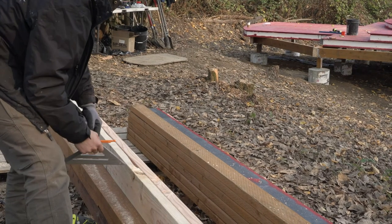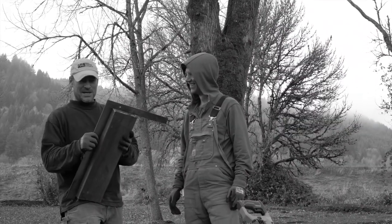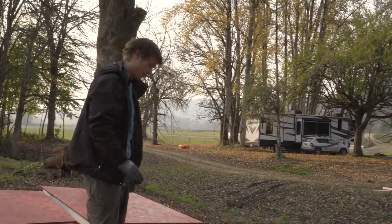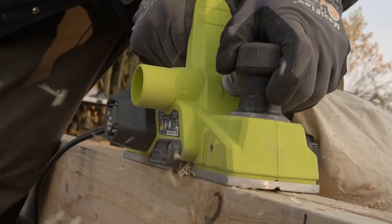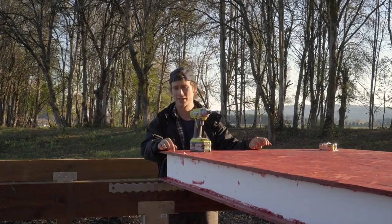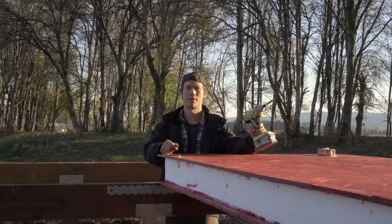That's the line that we need to cut to make that angle. How are we gonna cut these? Handsaw, like in the olden days. Now we're gonna take a planer, plane off a 16th off the top and bottom, and then bevel the edges to make a nice, easy fit. I think we're ready for the next piece, the holy matrimony of structurally insulated panels.